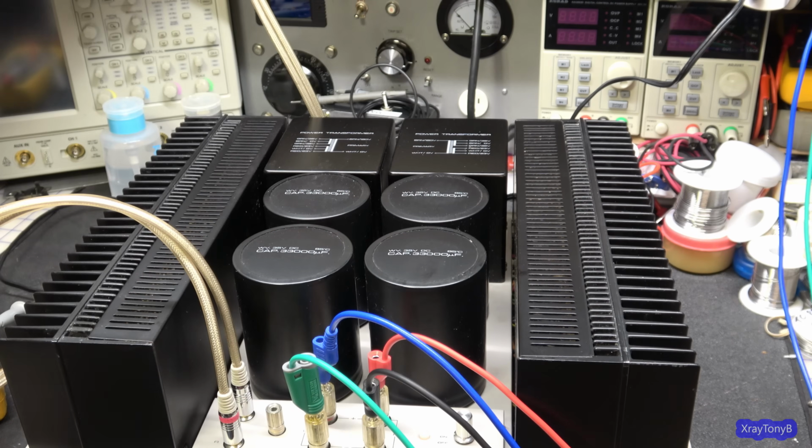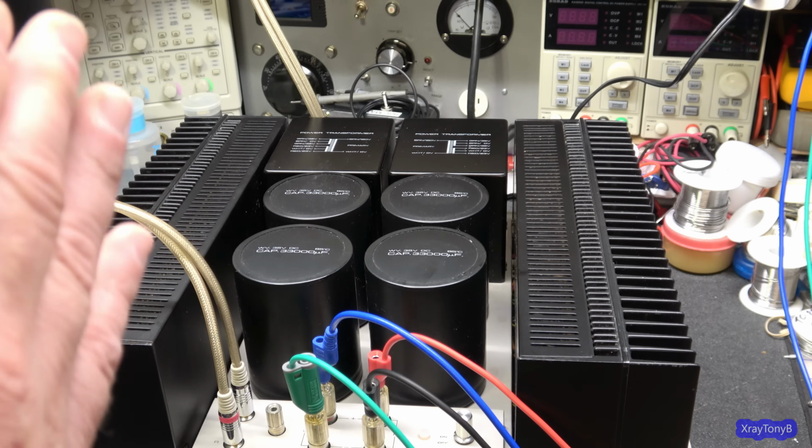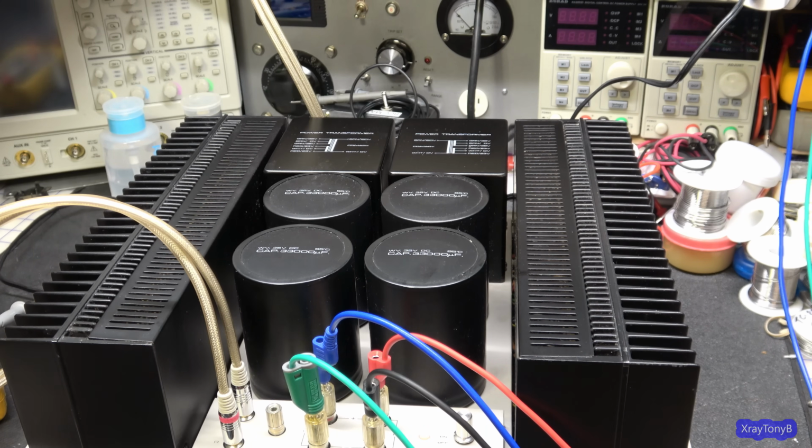And I'm going to focus the camera on the kilowatt meter. And we're just going to see as we turn the volume up on the amplifier if the current draw changes. You're probably going to see, in a Class AB amplifier, the louder you go, the more wattage you'll dissipate from the mains. And I have a feeling this is not going to do that, but we'll see.